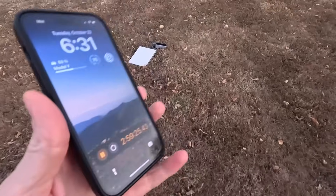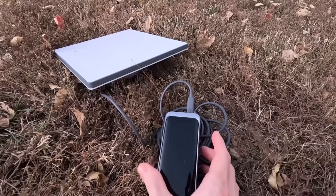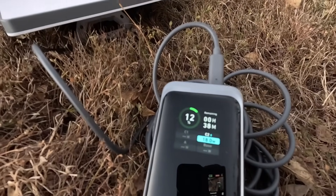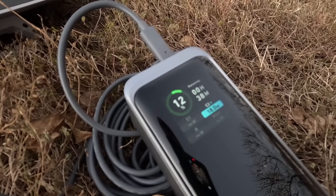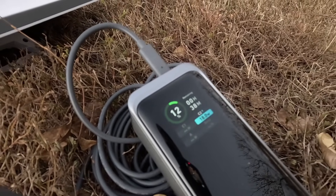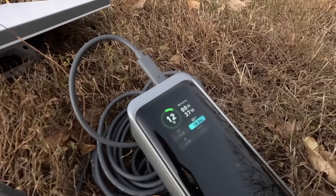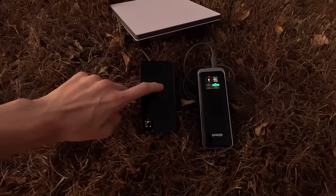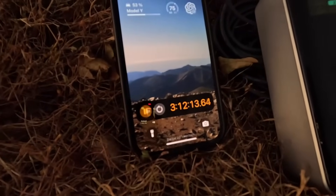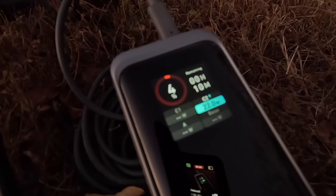At the three-hour mark and I'm running out of daylight — I honestly did not expect this to take so long to test. The 27,000 milliamp hour unit is still going. At three hours we're down to just 12% with 38 minutes indicated remaining. The estimate has been pretty accurate so far, but similar to the 20,000 milliamp hour pack, the last 10% seems to go really quickly. We're nearing the end at three hours and 12 minutes — just 4% remaining — still drawing around 22 watts, indicating about 10 minutes left.